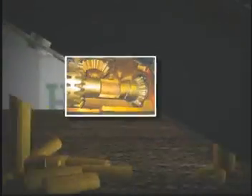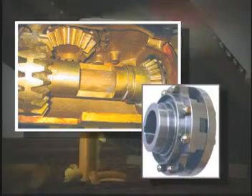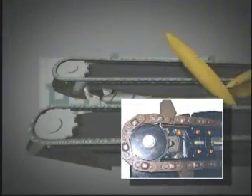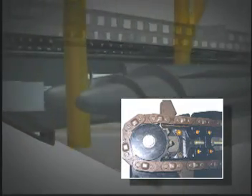Each Harvestec row unit and chopper is powered through a rugged heavy-duty gearbox with a torque-limiting clutch to prevent damage under excessive loads. This also protects the self-adjusting, spring-tension, heavy-duty gathering chains. The gathering chain idler sprockets are hardened steel with long-life heavy-duty sealed bearings, eliminating daily greasing.